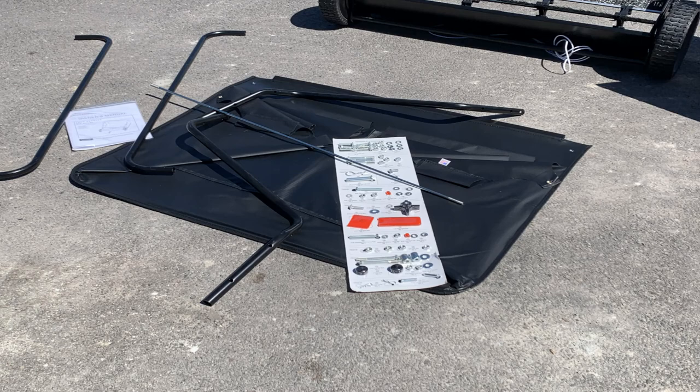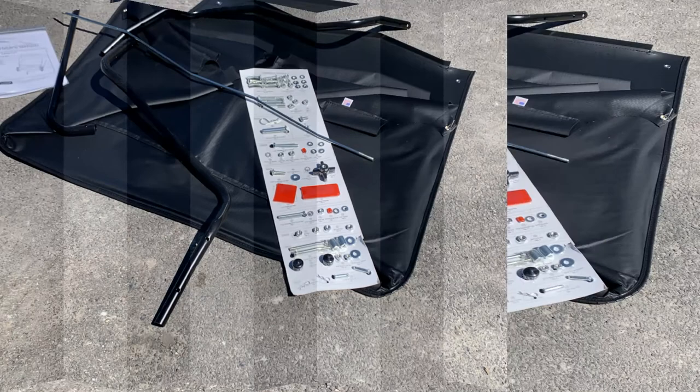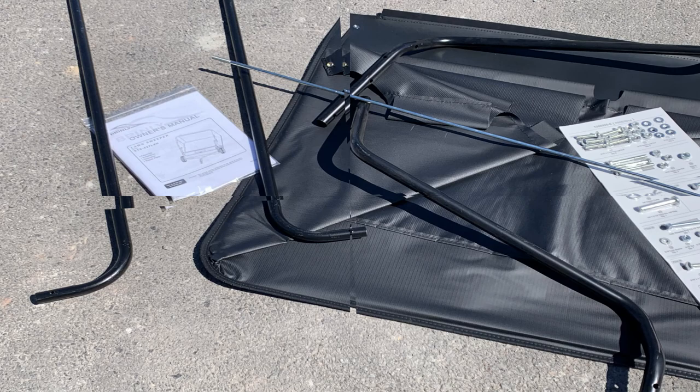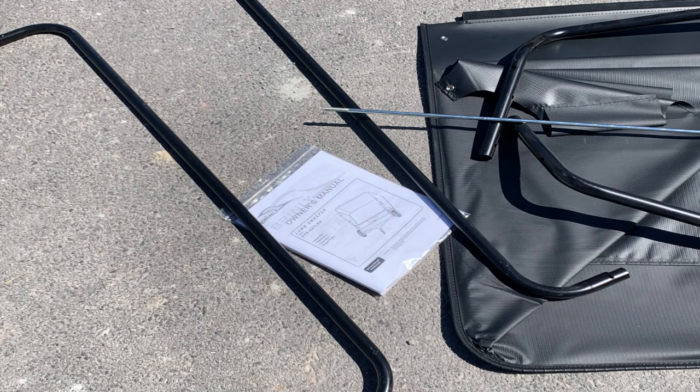Product overview. The Brinly 42 inch lawn sweeper is a tow-behind tractor attachment that collects leaves and grass clippings into its high capacity 20 cubic foot hamper. The 5:1 gear ratio results in higher tip velocity, generating more force to lift leaves and debris up off the ground and into the hamper. Consistent brush-to-ground contact prevents the unit from skipping and passing over sections of leaves and grass clippings on the lawn. By incorporating 6 brush sections, brush-to-ground contact is significantly improved over traditional 4-brush designs.